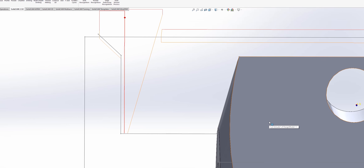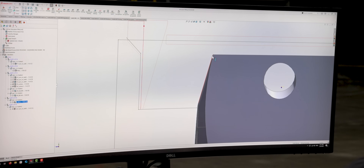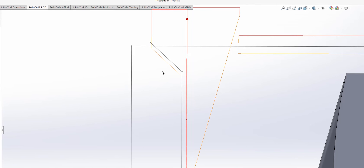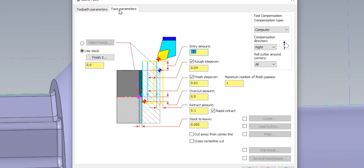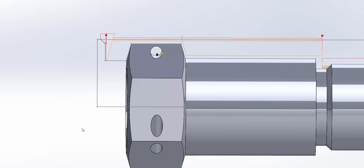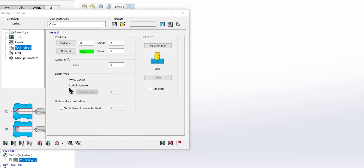I had a similar thing going on with the groove pass. I made an adjustment to the wireframe to put an OD chamfer on the back of my part so that my hex wouldn't have too many burrs, and then I added a little chamfer to the OD of the material so that there wouldn't be any burrs when it's retracting the stock. This is one of the simplest examples I can give you, but there's been so many times before where I've made a last-minute change on a model because of multi-axis work or even just simple milling, and I've had to reattach all of those tool paths to the parts because after making changes I'm basically reloading a new model and it doesn't know any of these tool paths anymore. I don't have to worry about this with SolidCAM, and I think that's really nice — you can make changes without it destroying your program.